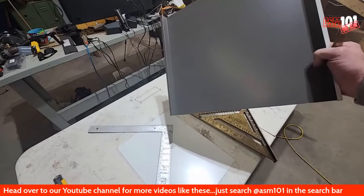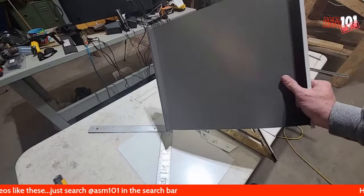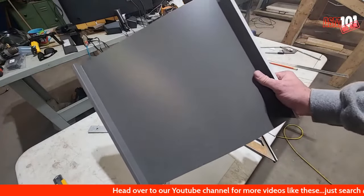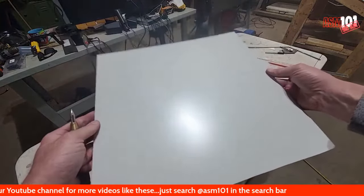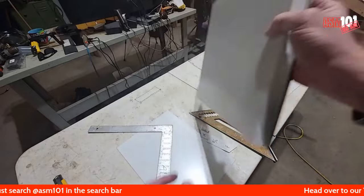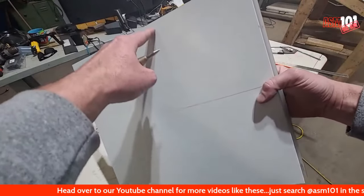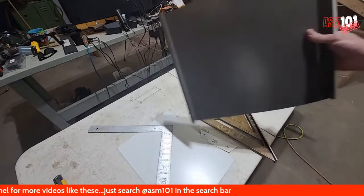So what I'm doing when I practice is I just get a panel about 18 inches long, or whatever. I have a line here, and that line represents the transition from roof to chimney. As long as you have, say, 8 inches going up the face of the chimney and 8 inches coming down the roof, you're good.